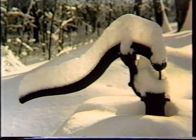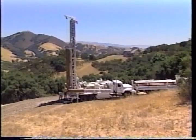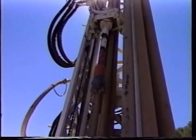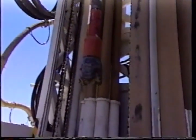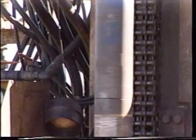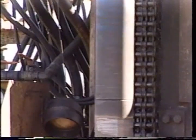Back in the early days of rural settlement, water wells may have just been hand-dug holes in the ground. Today's water wells use modern technology to efficiently reach the aquifers, and contractors use accepted well construction methods to ensure that the well is safe from surface contamination risks and will give the best yield available from the formations. Several techniques are used to drill water wells: the most common is the rotary drilling method; other methods are cable tool, jetting, and driven well points.